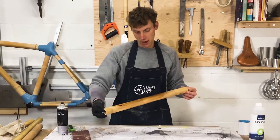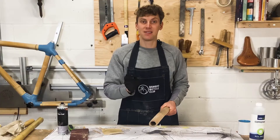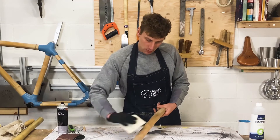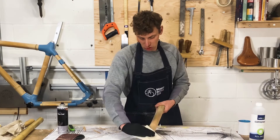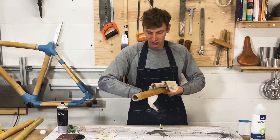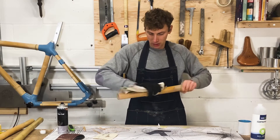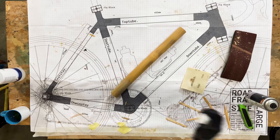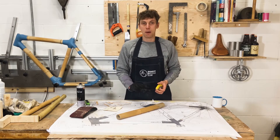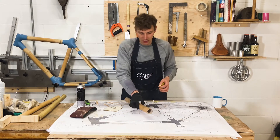Once that's dried, the final step is to apply a little bit of lacquer — that's going to give it a nice sealed finish. That's the dark stain, and it needs to dry until it all evaporates. The next thing I'm going to show you is how to do a painted finish on the bamboo — how to apply a color. Again, sand the bamboo back and get it as fine as you can. Once it's fine, clean everything and take your time — even clean off your work environment. I've got some leftover electrical tape and I'm going to create a line on the bamboo to give a bit more of an effect, showing you how to be creative.